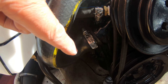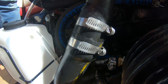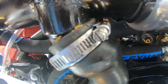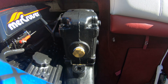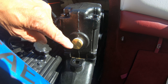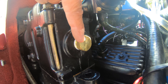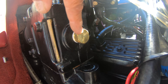Over here we have another pipe coming from the water pump located on the engine. Again, they provide a piece of pipe and two clamps where you can rotate this portion to meet the heat exchanger. There are one-inch lines coming off the elbow risers that connect to the manifolds — these have to be plugged with the plugs provided. There's one on this side as well. That one's not so hard to take off because it's brass on iron, so it'll come off okay.